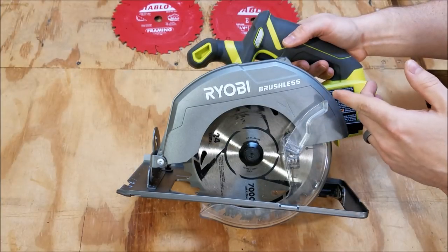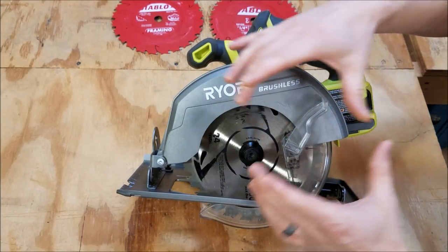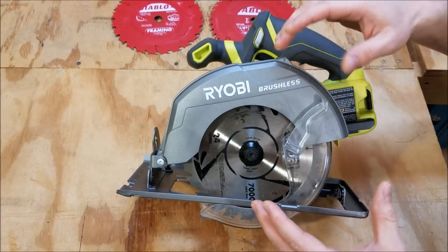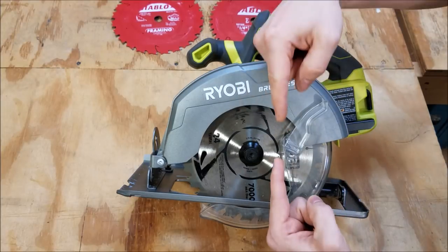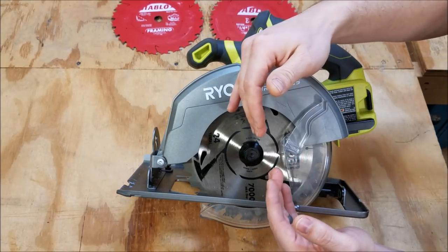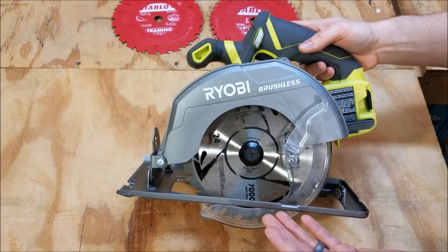The advantage of the brushless motor is that it's an electronically controlled motor with the magnets on the rotor and the windings on the outside, with a circuit that switches the polarity of the windings causing the motor to spin. With a brushed saw, you have losses because the windings are on the inside of the rotor and carbon brushes contact them to switch the current, constantly creating a drag force and heat. So the brushless motor is more powerful and more efficient, giving you longer run time out of your batteries.